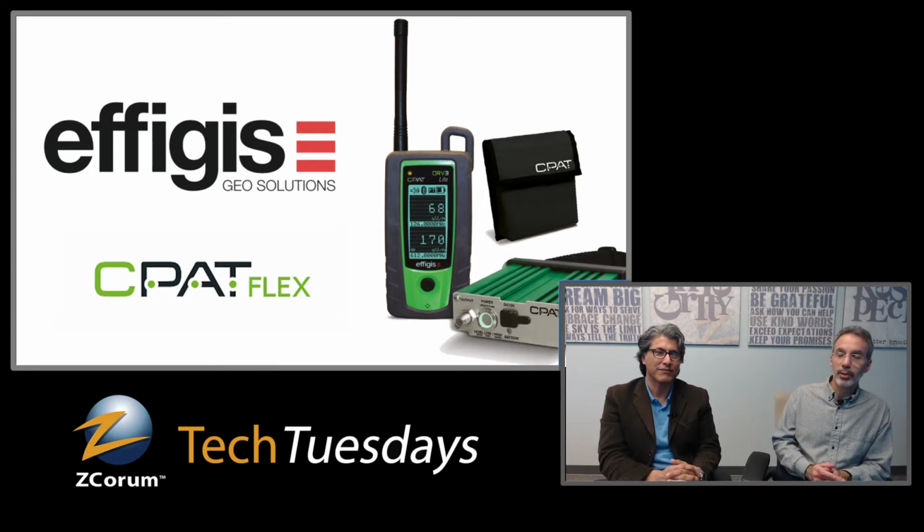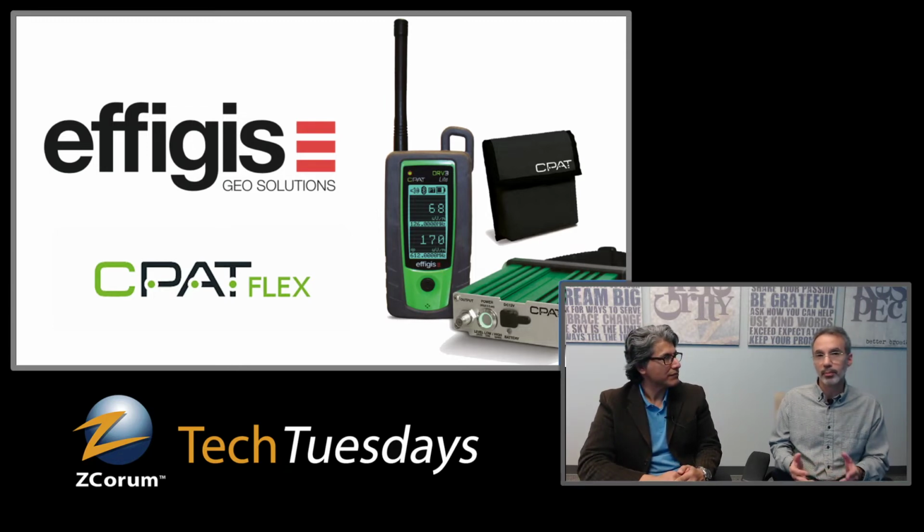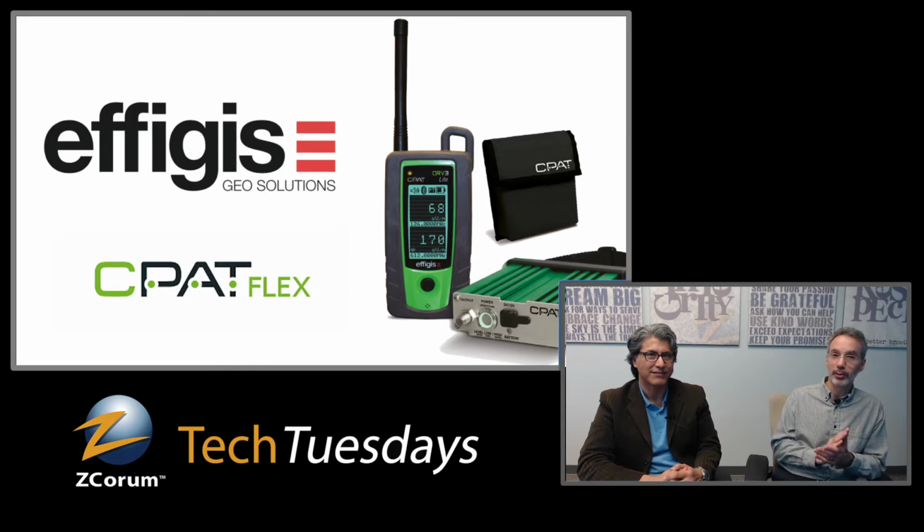And again, with these modems being intermittent, a lot of times that will mean that modem's not being impacted all of the time. So it's not like the steady noise we were talking about a couple of weeks ago with Brady. If they're growing pot in their house with grow lights on, that might produce a steady level of noise. But because they're intermittent, what this kit will do is make it not intermittent anymore, because you're injecting this signal into the cable plant, driving that noise down the line, and you will find the leak.